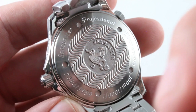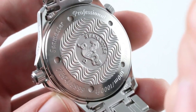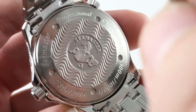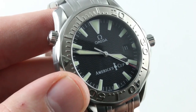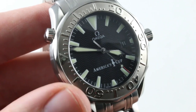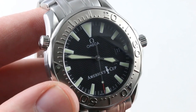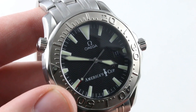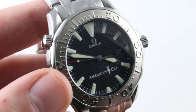Let's take a look at the case back — it is a commemorative case back. Just under 10,000 pieces; the demand for these seems to be pretty brisk and robust, and though they made almost 10,000, they tend to sell quickly and are widely sought. The design is unique — this is not a standard SMP 300 case back, so there is a sense of occasion here too. Chronometer is noted on the case back, assuring you that despite its absence on the otherwise clean dial, this is a COSC-certified precise Swiss timekeeper. Since it is pre-coaxial, it beats at 28,800 vibrations per hour, chronometer certified, with a 44-hour power reserve. It is a little bit upgraded from a standard ETA base — Omega added a free-sprung balance as well as custom finishing to improve robustness, winding efficiency, and aesthetics of the movement.